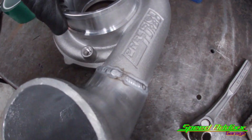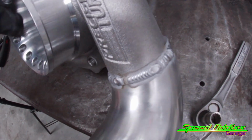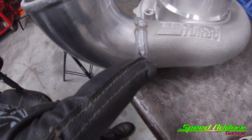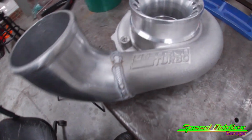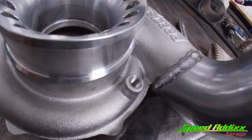Your boy was feeling kind of good, so I went ahead and laid them stack of dimes. I went from 150 amps, then I went up to like 170. The piece started getting hot, so I backed it back down to 150. But yeah, man, them things stacked out pretty well.